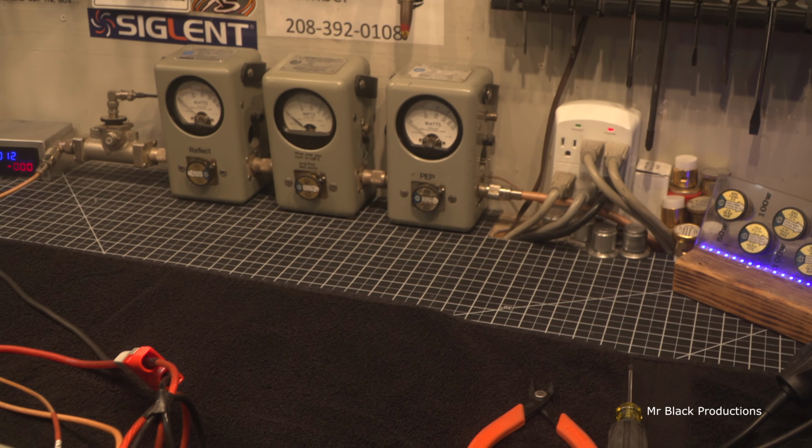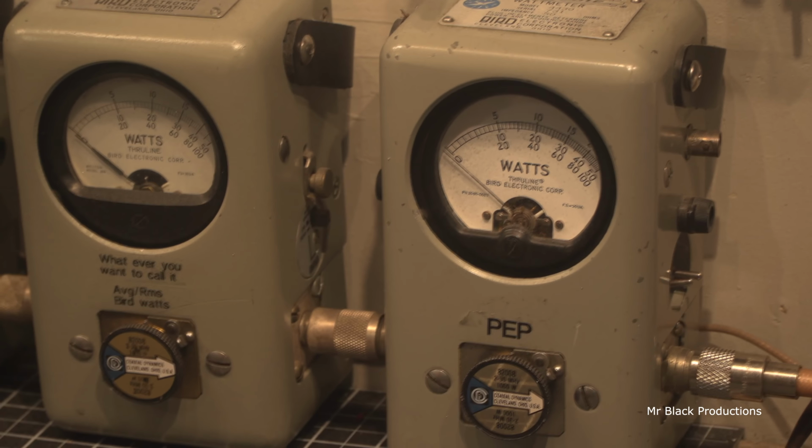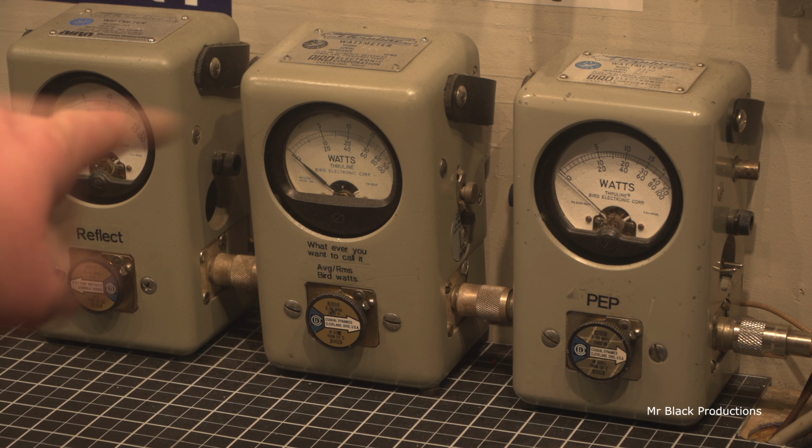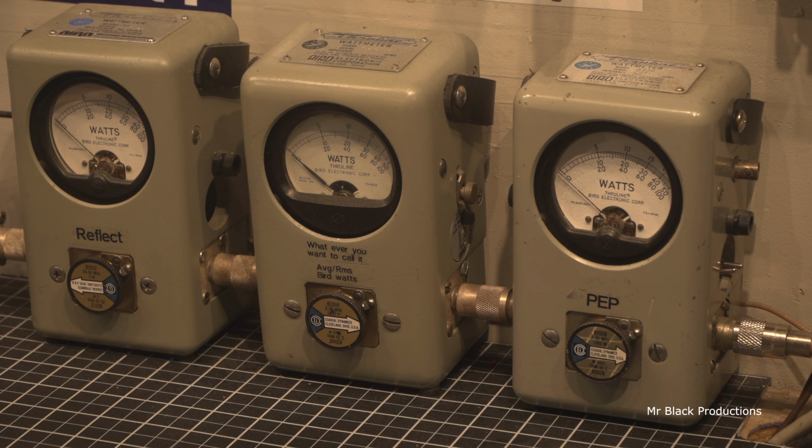Powered up. It's a 1,000-watt slug in peak, 1,000-watt slug in average next to it here, 5-watt slug here. So we're on 12 volts at the moment. Let's turn the amp off. Hello, 1 2 1 2. All right, let's turn our dead key down on our radio and put that in a forward position. We'll dial this down to 1 watt or just a hair below it. Remember, this is a 1 driving 2. Hello, 1 2 1 2, which means low drive. All right, amp is working.